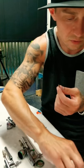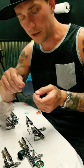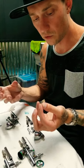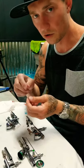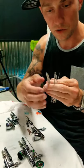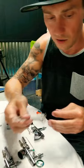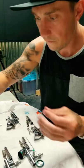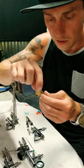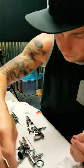Sometimes you will have a couple of little particles in there that are hard to reach — that's when an ultrasonic cleaner will come in handy. You can fill it up with a solution, let it soak, and it will vibrate slowly and break loose any little particles. But if you don't have one of those, you can get these pipe-cleaner style tools — basically the same as the wire brushes but without the brushes — in all different sizes. They're perfect for sticking down in there and working it to break stuff loose.